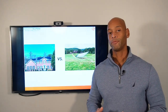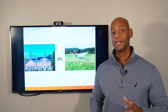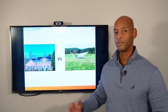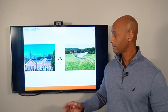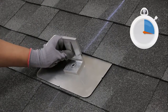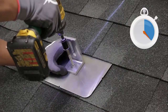The traditional roof mount solar system is going to be in most cases the best dollar-for-dollar payback. The reason is that when you install solar on a roof you can use the roof rafters or trusses as the structural support for the system. We just use a few pieces of lightweight aluminum rail and mounting brackets, and a four-and-a-half-inch lag bolt that bolts into the roof rafters or trusses to make the structural support.